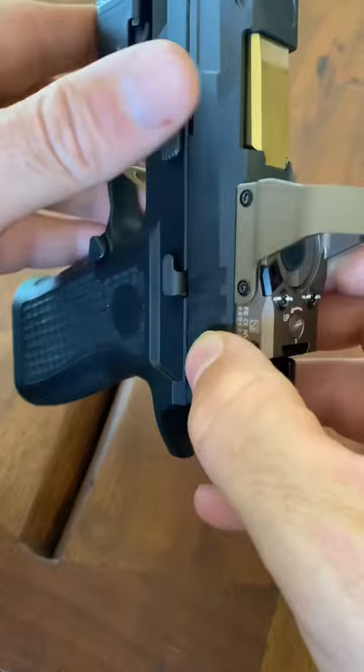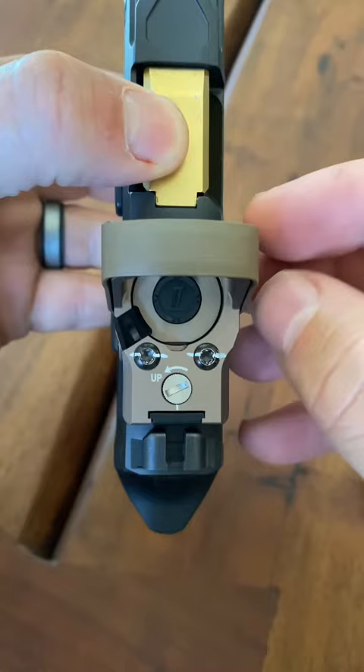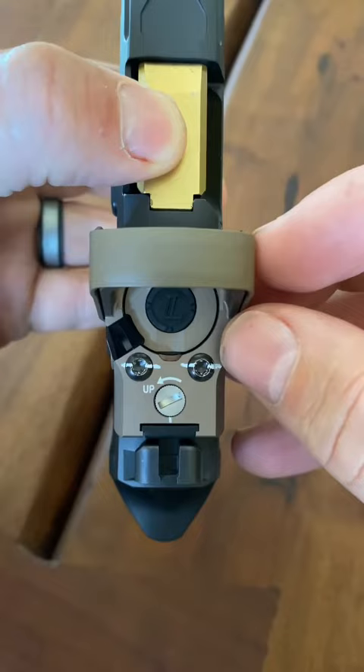First off, I had a lot of issues with these screws loosening. So what I did is pulled them out, re-torqued them, and — I don't know what kind of thread locker these come with, but there's some on the screws already — I cleaned that off and put some VC3 on. I've also put some witness marks on here just so I can monitor the situation.